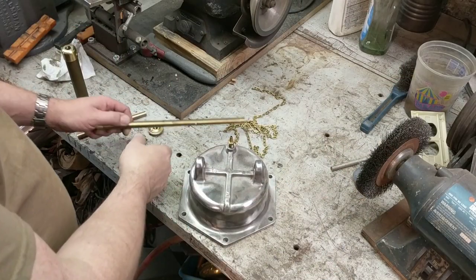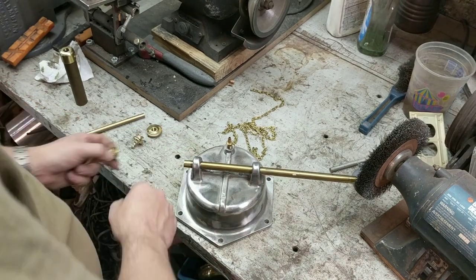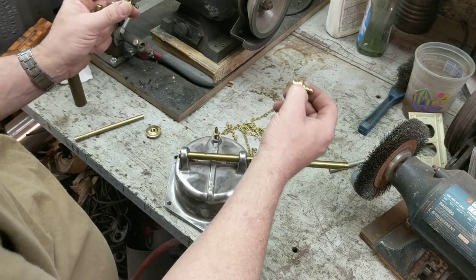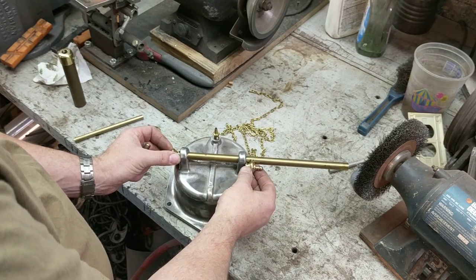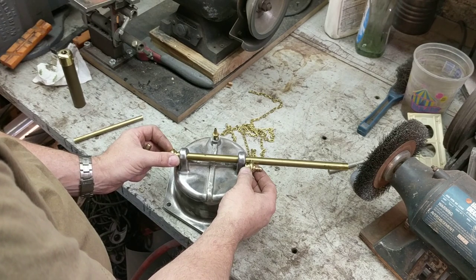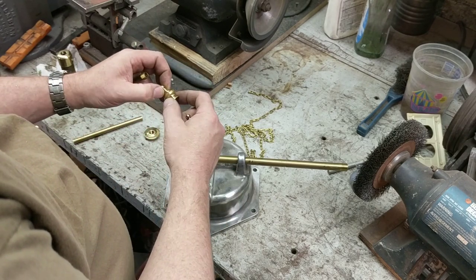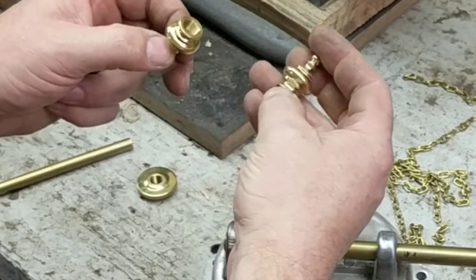Moving on, I need a way to capture this shaft inside these lugs. I thought about a set screw, but from a decorative standpoint I'm going to attach these finials - these are off of a stair rod for keeping a carpet runner in place on stairs, kind of Victorian. I'm going to install these finials on here. It's a little edgy as far as being too decorative, but I think the thing needs dressing up. Actually, what I'll do is turn off the very top finial so they're not quite so gaudy - remove everything from this point up - that'll be a little more muted.